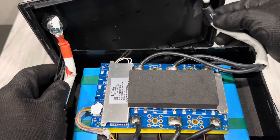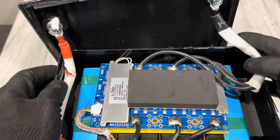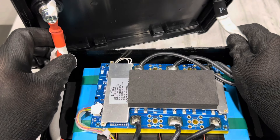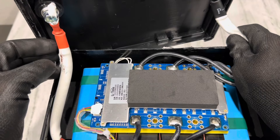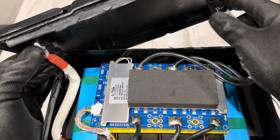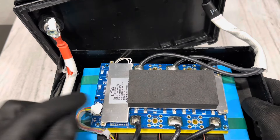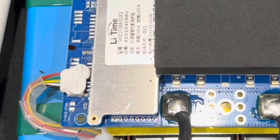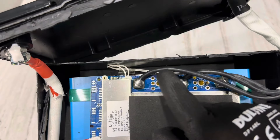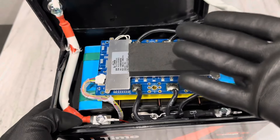Let's start with the wiring. Going up to the terminal post on top of the battery, we've got three 200-degree silicone-jacketed number 10s on the negative side, and then the positive side is a single number 6, 200-degree jacketed conductor. They cut the extra insulation off — there's a protective jacket on top of the actual wire, which is nice to see. Hydro-crimp connections. Nice sealant so the terminal bolts don't back off. Nice solder connections for the battery leads and output leads on the BMS. The BMS is a LiTime-branded 100-amp BMS. We've got balanced leads going down to the cells, and a thermal switch on the side of the cells.